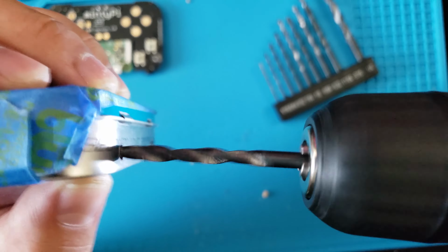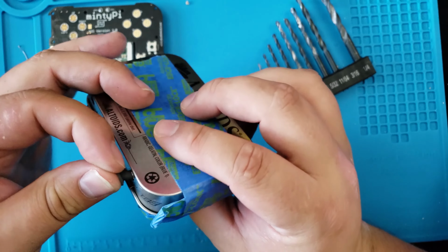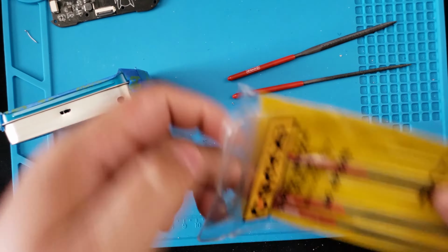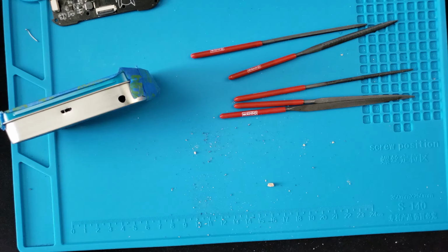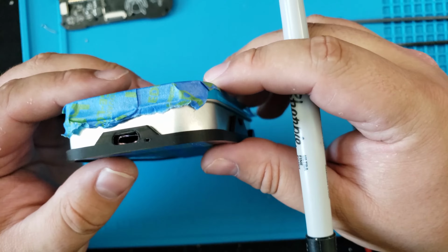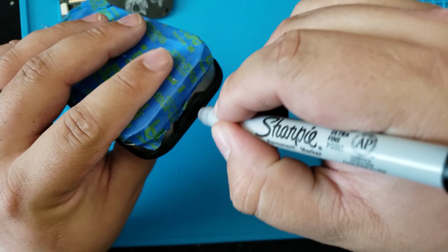As you can see here, I've stepped all the way up to fit the L&R buttons in perfectly. After everything's been drilled, I put the template back on just to mark what little pieces I had left to take off with the file. I took my fine tip Sharpie and marked the edges so I could make it just as neat as I could.